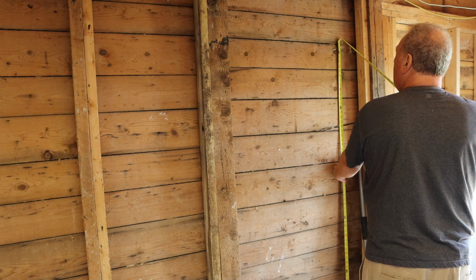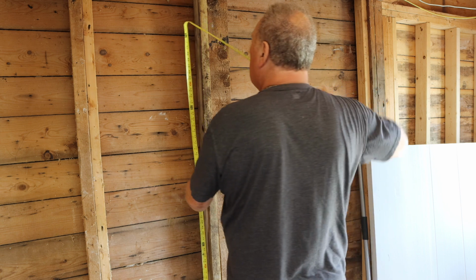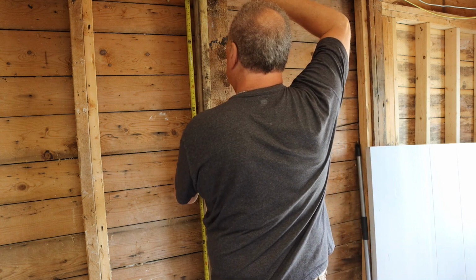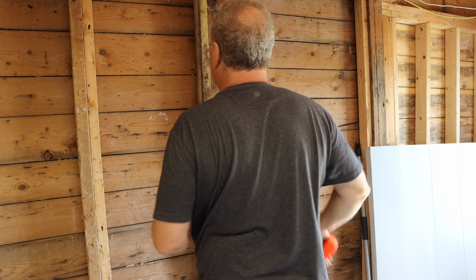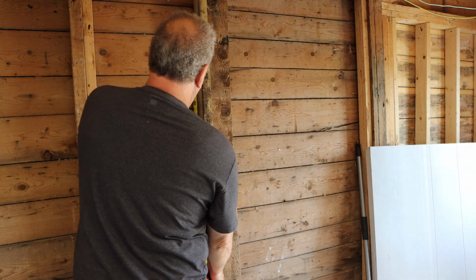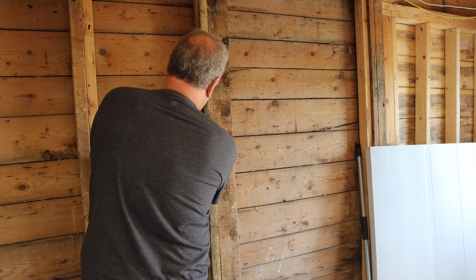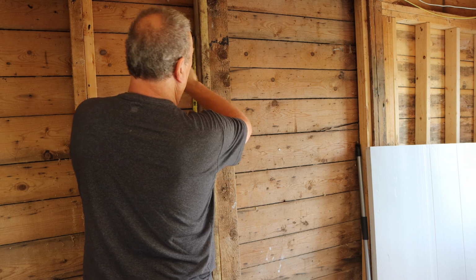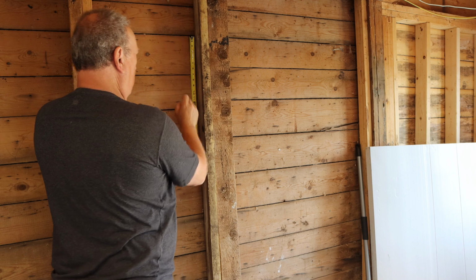The height is 73 to the hole. So I'm going to come here. 73 is right there, so right at that intersection here. So I said that I needed to be 10 inch to a foot under that dimension. So that's your foot right here, and I'm going to use that. 10 inch was pretty tight, especially when you have to put trim on it and all that. So I'm going to take a good foot out of it.